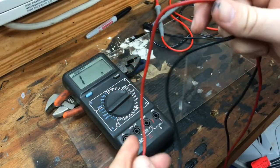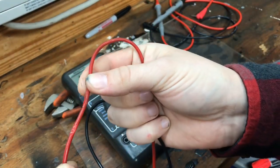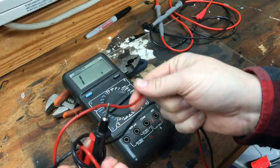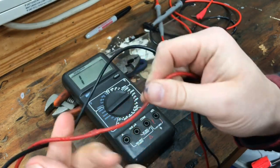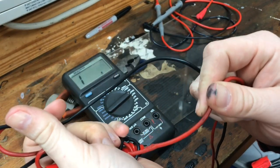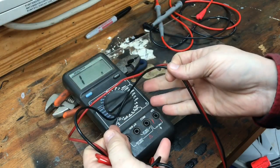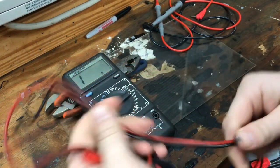One other point I want to bring up is, if you have damage to your wire leads like that, and if it was showing bare wire, and you go test a high voltage system with bare wire showing and accidentally touch it on some bare part of your body while you're grounded, you're going to get a very bad shot. So not only is doing this good for making sure you're getting good readings with your multimeter, but it's also a safety concern too.